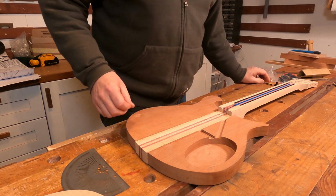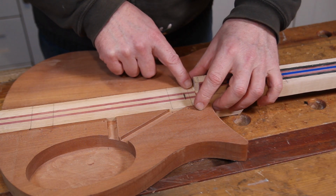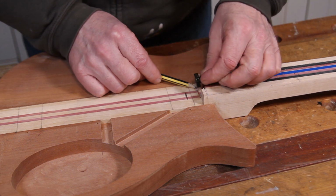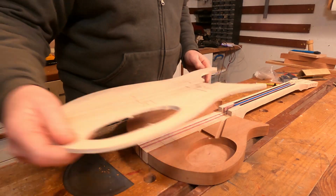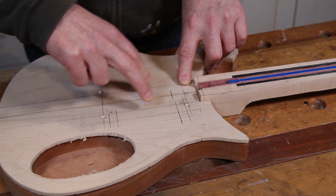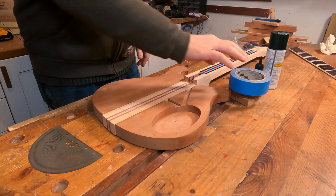So I think all I'm going to do is find some bits of 18mm MDF and create a very temporary template. I need to make sure that it's wide enough for this adjuster just to come forward that little bit. With that done, we can then put this in position, fasten it down, redo our little template on here, and just route in that little bit as well.